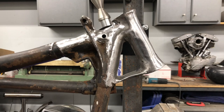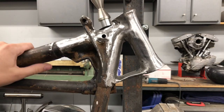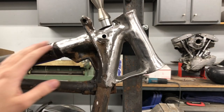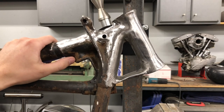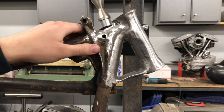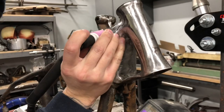In the best interest of the customer, we decided we're not gonna powder coat the frame, so I don't have to go and fill every single little pinhole — that would be very time consuming and cost him a lot of money. So as an option, we went with painting the frame and Bondoing any low spot or high spot to make it look uniform. It's definitely the easy way out, and depending on who you talk to they're gonna say I'm a cheater, but I'm all for looking out for the customer. So I'm gonna fill these holes and finish up the rest of this.